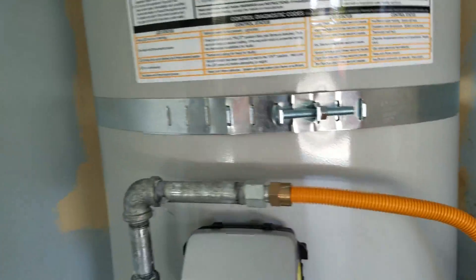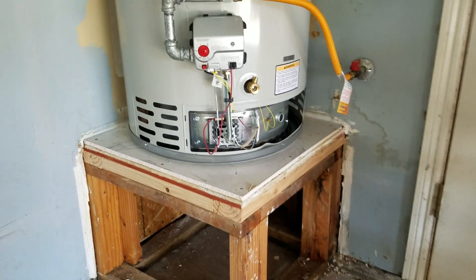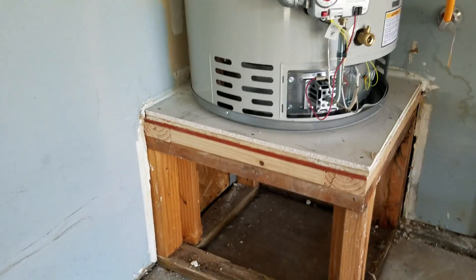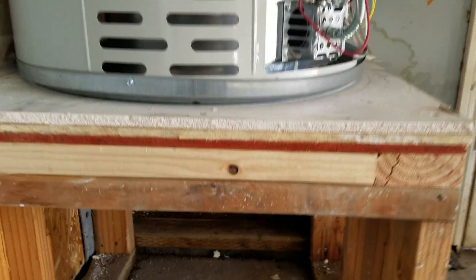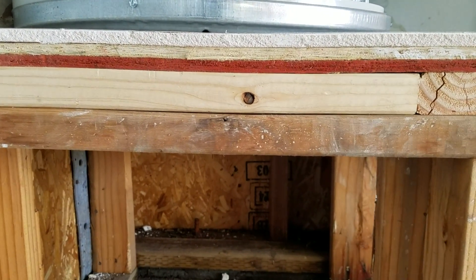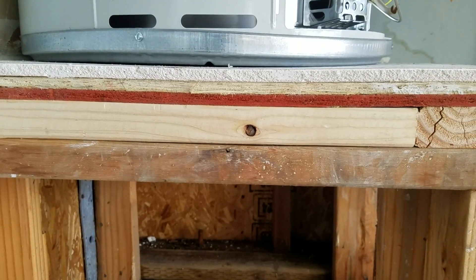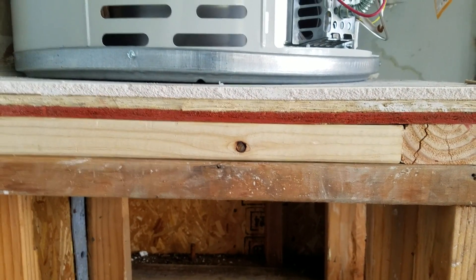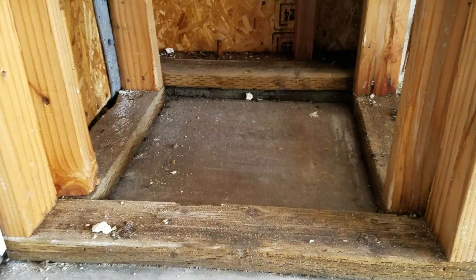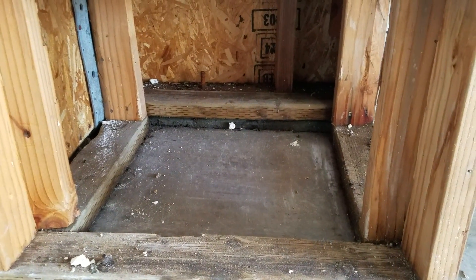What we've done here is just a partial rebuild of the stand, pulled it back, and everything was soaked. So we pulled back all of the sheetrock, and then of course we stiffened up the existing platform. It only had one top plate, so you can see we've capped it off and doubled up the thickness here. Brand new 2x4s all the way around on the top, two layers of half-inch OSB, and then a layer of half-inch sheetrock. We're leaving this open right now — you can see it's pretty well dried up already just from this morning.